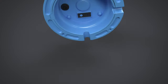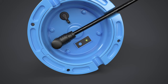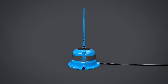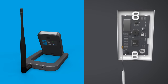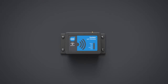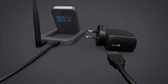Take care to align the sensor to the connector on the base of the tank centre. Turn the thumbscrew clockwise to lock the connector in place — this step also powers up the tank centre. The antenna can then be fitted. The antenna for the desk-mount WiFi LCD keypad should also be fitted at this time; the wall-mount keypad antenna comes pre-fitted by the factory. If you have the WiFi gateway, simply fit the antenna to the top of the unit. The power supply for the LCD keypad or gateway can then be connected.